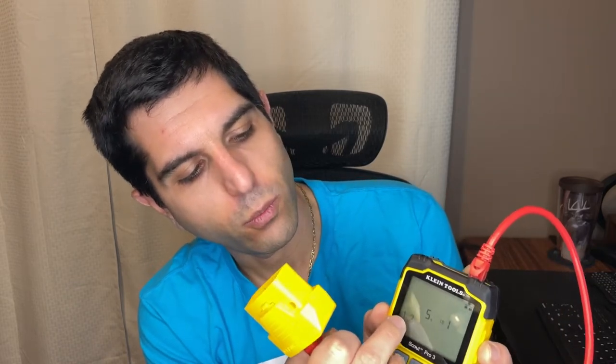The cool thing is there's a button that will tell you what numbers are showing. For example, if this says lines 1 and 2 are dead, it'll also say lines 1 and 2 are 5 feet long. So if I have a cable in a wall and lines 1 and 2 are bad and reading 5 feet while the rest are 40 feet, I know the cut is 5 feet from my end — maybe a nail went through the siding, a screw went through drywall, or it got pinched in the wall at a turn. I know exactly where to cut the drywall open.